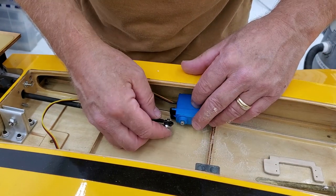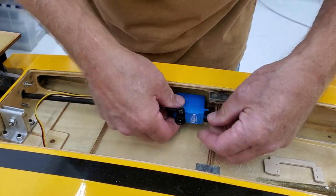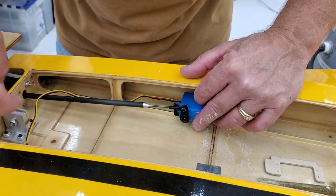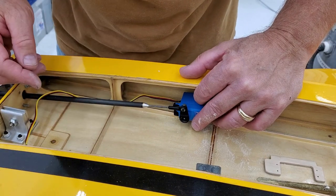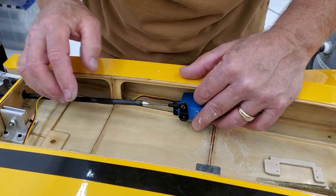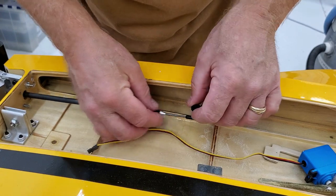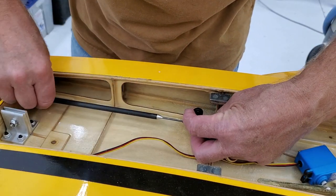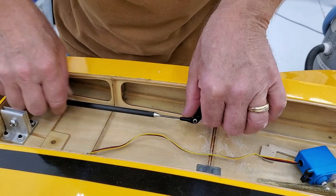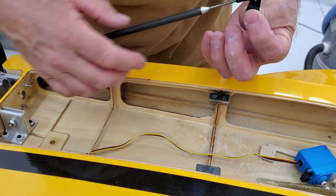Part of what we're dealing with here is the steering shaft and where it will go through. If the servo is down low, can you see the angle of that shaft as it's up high and angles down? I don't like that — it would probably work just fine, but I like it to be parallel to the bottom. I just like things to look right. Having it down low gives it this nice parallel-to-the-floor look and gives me a nice 90-degree angle here where this mounts. I don't want to be coming down at an angle because I don't have my 90.